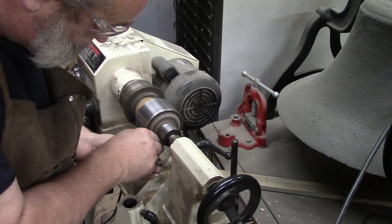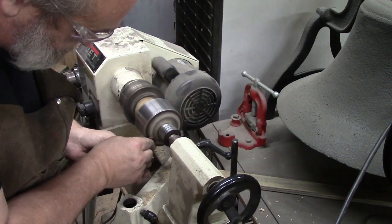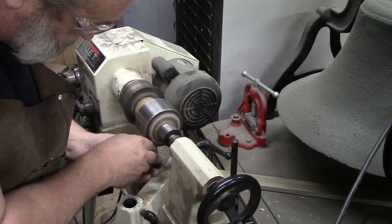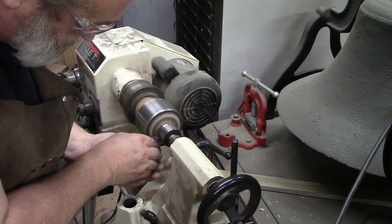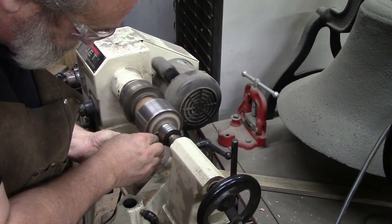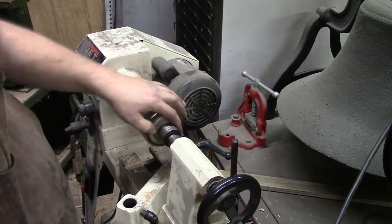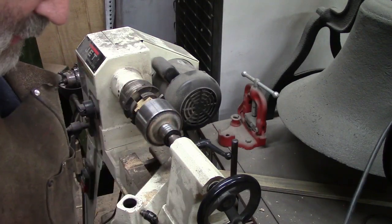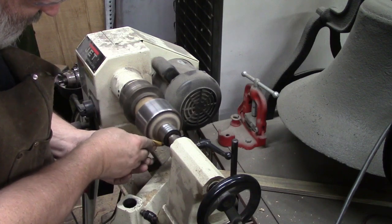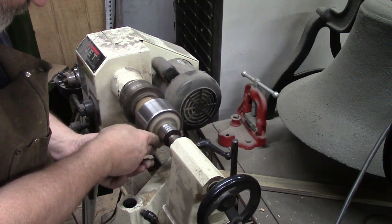That way I can do the edges of the metal, and the back side, and it'll be still round, basically keeping it in a flat orientation. Well, look at what we got, and it's sanding up pretty good. It doesn't have to be perfect, just got to be smooth. This is fairly coarse grit, probably about 80 grit. And then I have 120 grit here to come back and make everything smooth. We can even do the tire part with this if you want.